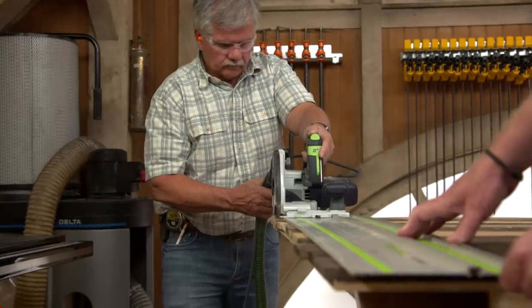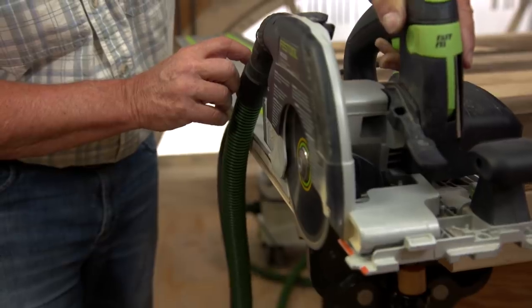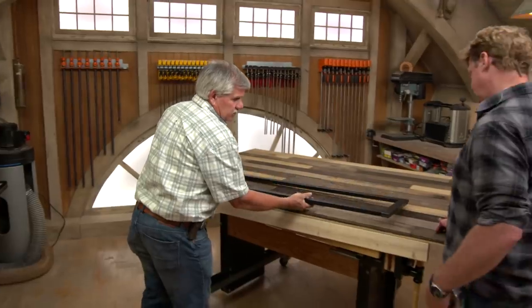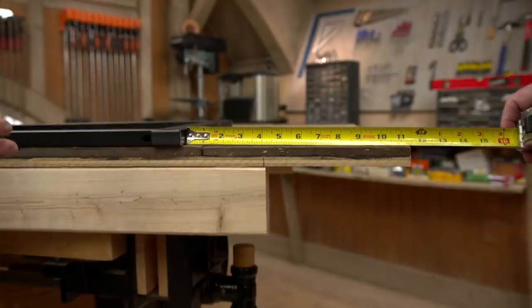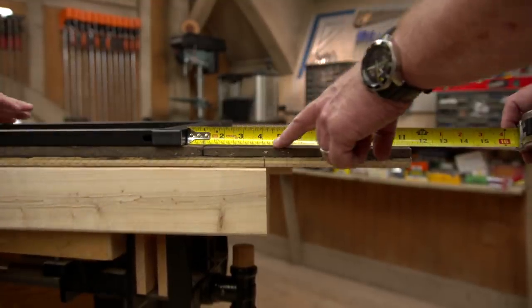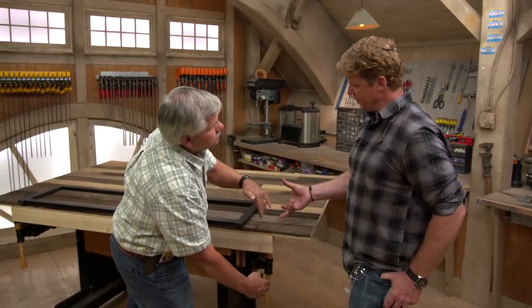With all the boards in place we can make a clean cut on both ends. Here's a piece of our metal frame that's going to hold the mattress — it doesn't require a box spring. The measurement we're going to have on each side of the frame will be about five and a half inches, but we can make that measurement whatever we want — it could be two feet, it can go behind the nightstand or flush with the metal frame. This piece right here we're going to cut off so we can return it down and go to the wall, to give some depth to this piece.